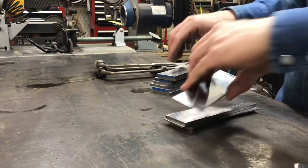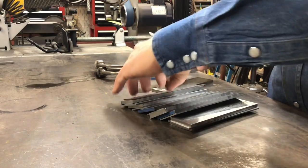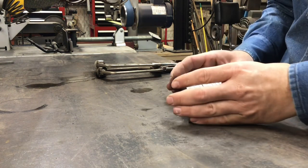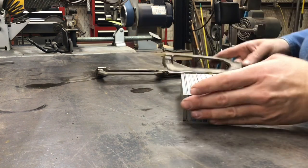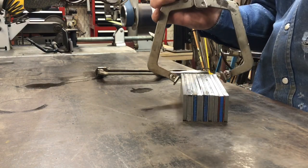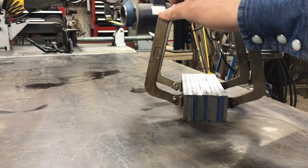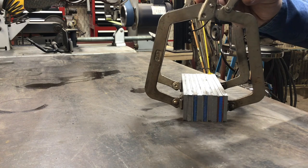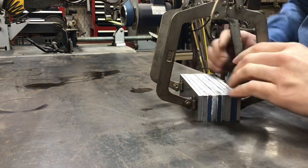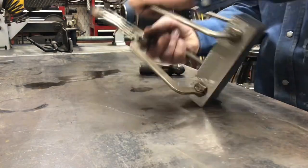The first thing is we're going to put the thicker piece of 1084 on the bottom, and it's also what we're going to finish with on top. If you've made damascus before, you know having those thin pieces on top or bottom they'll buckle quite a bit. If you're just tacking it together instead of seal welding the whole thing, it helps to have a thicker piece on top and bottom. We are just alternating the high carbon and then the high carbon with nickel every other piece, keeping everything square and lined up. We've got 17 layers here, so that's where we're starting out.